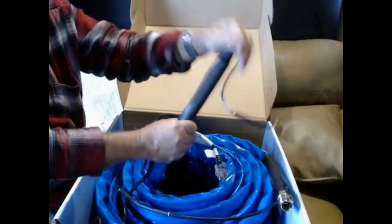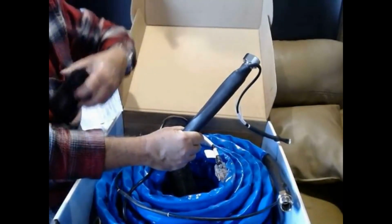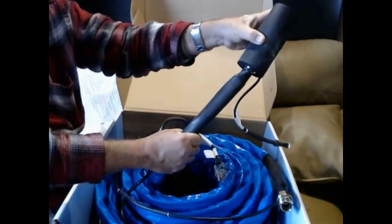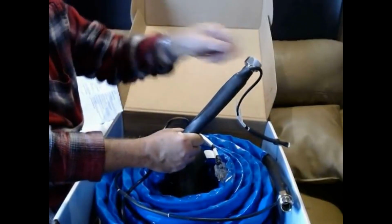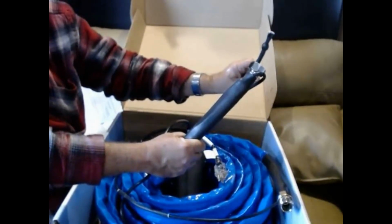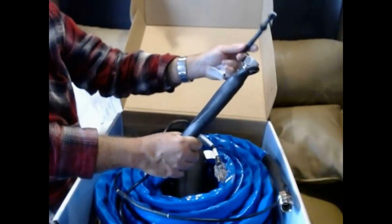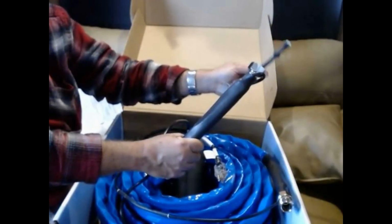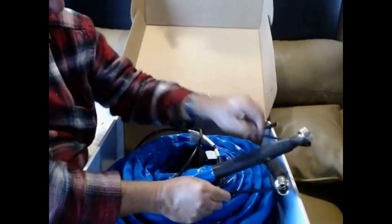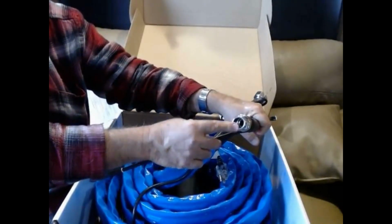But this is going to actually be underneath a bucket and underneath some insulation. And something I saw that the company provides that really impressed me is this insulating sheath that I presume is made to go around this and protect the connection between the hydrant or the spigot and the hose itself. But the thermostat must stay outside. It must be outside of that bucket. It must be exposed to the ambient air. That will keep the hose functioning properly. So when the temperature gets down anywhere near freezing, the thermostat will trigger the hose to heat up, and you're good to go. Now, the other end of it, this end, is what's going to go into my camper. And we have a couple of things here.